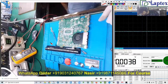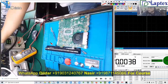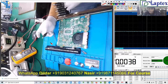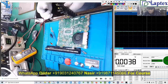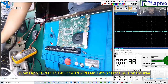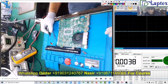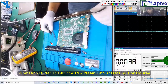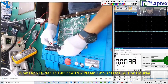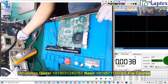Now let me inject the DC jack into the motherboard. Since this is a Dell, I need to take out the Dell PS ID. PS ID is required to charge HP and Dell laptops — all of these are PS IDs I am using instead of using an adapter. Different types of PS ID come, like 65W, 90W, 45W. I have a 65W PS ID here. Let me inject it and increase the voltage to see the scenario.